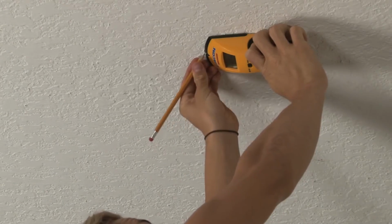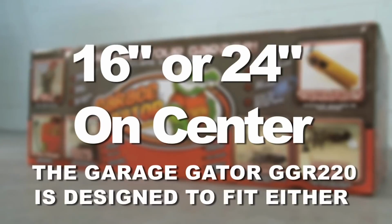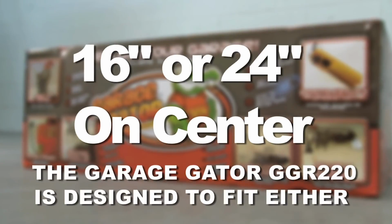Use a stud finder to determine where you want to install the Garage Gator and which way your joists are running, and if they are 16 or 24 inches on center. The Garage Gator is made to fit either 16 or 24 inches on center.